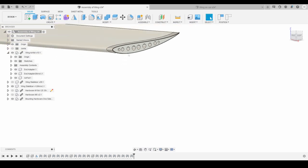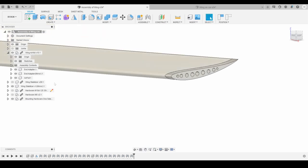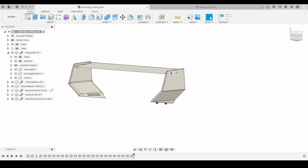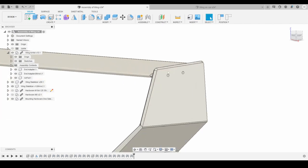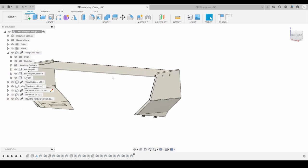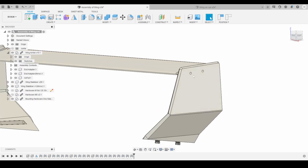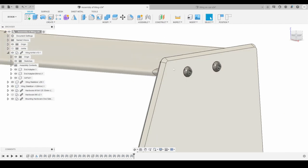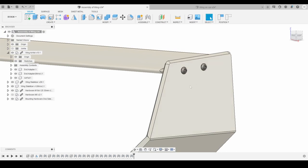This will all be wrapped in carbon as well, so this shouldn't be a tear out or pull out situation. It should just hold relatively well. And it's being sandwiched too, so that should help with taking the load also. Most of the load shouldn't be lateral, it should be vertical, going down or up, depending on the situation. So I don't have to worry about much of a tear out, but I will have washers on the edge of this just to hold a little bit more and disperse the load over a bigger area.